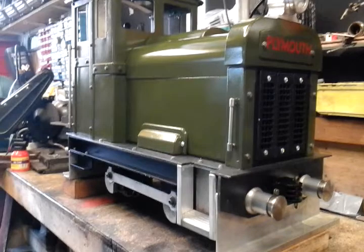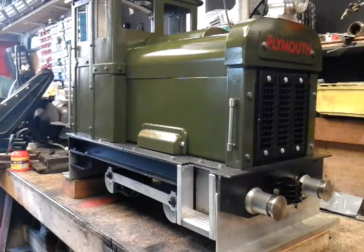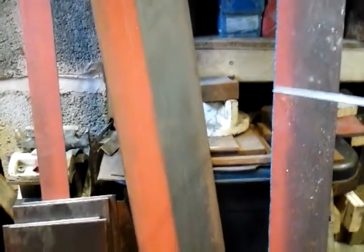I'll just show you what I've done, because I'm going to make this like I've done this one. I'm going to make this steam locomotive, Meter Maid, on a budget again. And I'm not going to make a bodge job. I'm going to make a proper job, but I am going to do it as a budget build. Now just an example. When I say a budget build, I've bought this steel here for main frames. They're 30 inch long, and I could have bought bright mild steel flat bar with square edges at the correct size, but I got this steel cheap, but it's 6 inch wide and I need 4 inch. So I've set to and I've sawn all the way down one edge to make it four and an eighth wide.